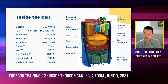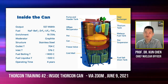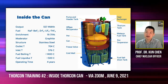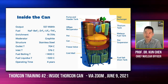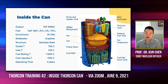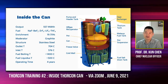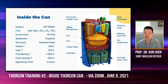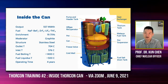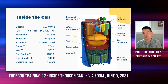On top of the pot you can see several tanks. This one is what we call the off-gas recuperator. How it works is that the molten salt reactor always has a cover gas — in our case we're using helium. Helium is a very good gas because it cannot be activated, so it's not radioactive. Also, it's easier to separate xenon and krypton from helium. If we used argon, the argon would be activated and become radioactive, and it's also hard to separate from other fission gases.